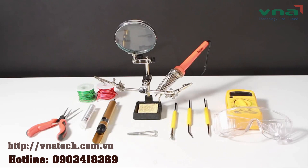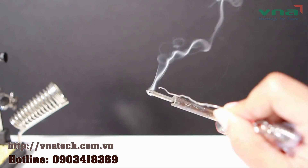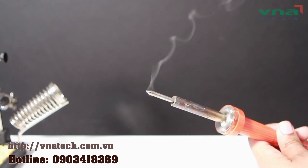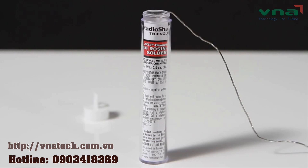This is important for both productivity and safety. Soldering will result in varying degrees of fumes that you should try not to breathe in. Make sure wherever you're soldering, fresh air can circulate. Solder also contains lead, so it's best if you cover any open sores and wash your hands afterwards.